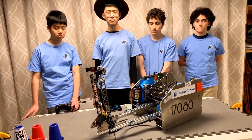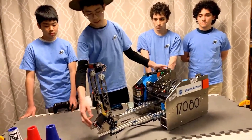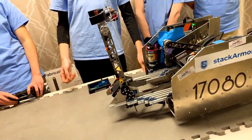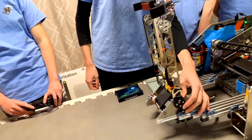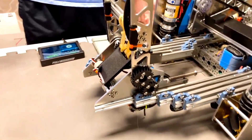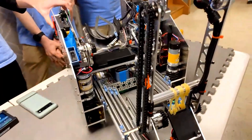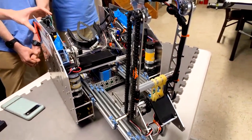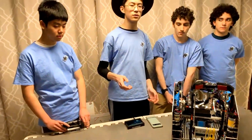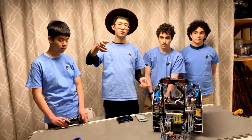Jumping into your arm, walk me through that and give me an overview of it, and then we'll also talk about the software and how that works with the whole intake. Our arm is a custom machined driven four-bar. The arm is powered by a servo geared to its base, which lets us accurately control its height so we can intake both from the stack and from the ground and also for our transfer. A chain running alongside it connecting to the end allows us to hold the intake claw at the same level no matter where the intake arm is positioned. It's connected to a servo as well, which means we can pivot it forward and backwards, which is especially useful during our transfer when it needs to pivot backwards to make sure it securely fits.